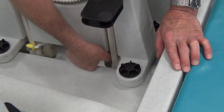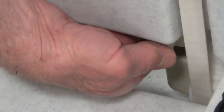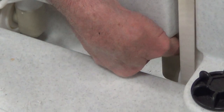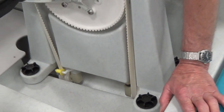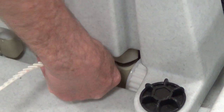This is removing and reinstalling a drive belt on an Encore. First, reach down in the front and loosen the thumb knob. Turn it clockwise a couple of turns, and that loosens the belt. Then just take the belt and pull it off, which will let the belt come off of the sprockets.